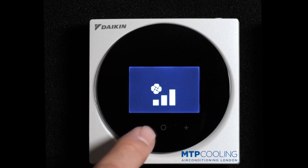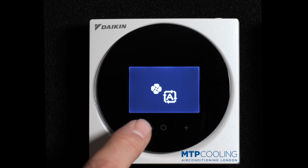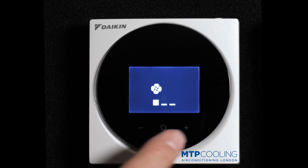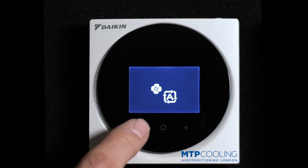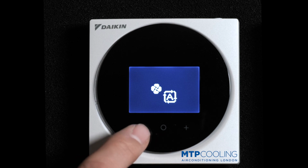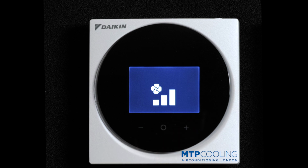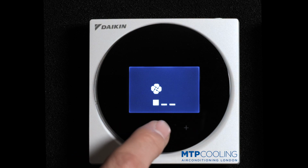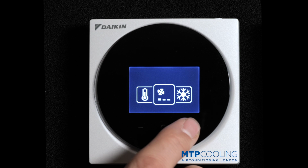If you go into that folder, you have a selection of speed and automatic speed. Now, you can have either 2 speeds, 3 speeds, or 5 or 6, but that only depends on the type of the indoor unit this controller is connected to. The unit which I'm using in this example has 3 fan speeds and automatic mode, but some of them can have only 2 or 3, no automatic modes, and so on. Whichever fan speed you select, just press the middle button. That is now set.